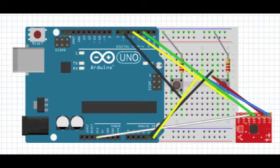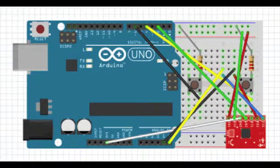I then connected a wire from pin 2 in the top header to the INT pin on the sensor. This is how the button interrupt is able to tell this sensor to calibrate itself. When the button interrupt happens, it sends a specific serial data entry which the code recognizes and tells the accelerometer to zero itself out to get ready for the next swing. Finally, there are 2 jumper wires connected from pins VDD and VIO to ground on the top of the board. This is how the sensor releases the current sent in from the Arduino Uno.